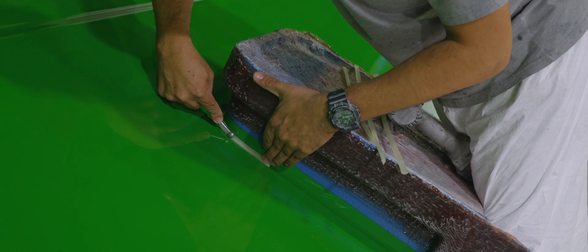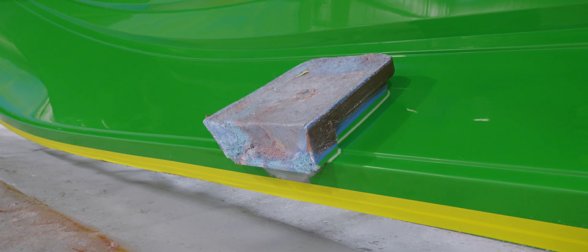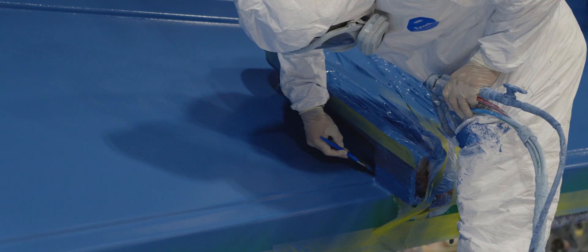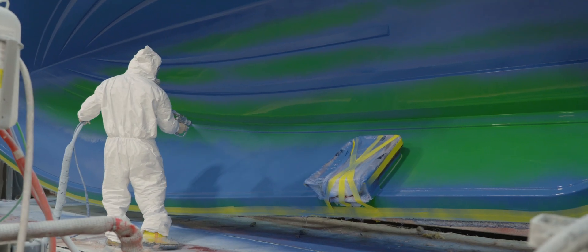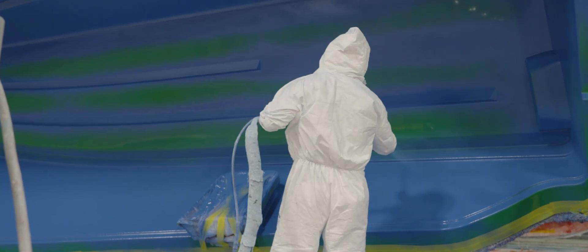The wax strip step plays a pivotal role later in the post-production phase, minimizing rework. Gel coat is then carefully hand-applied around the door area to ensure an even coating. At this point, the entire hull side and bottom are sprayed with the matching color gel coat that was previously applied around the door area.